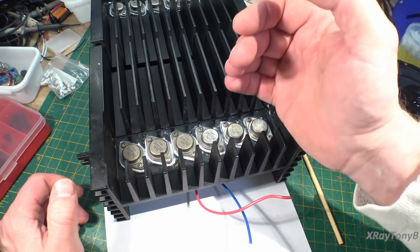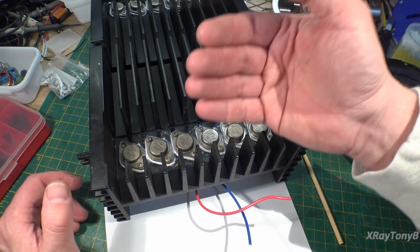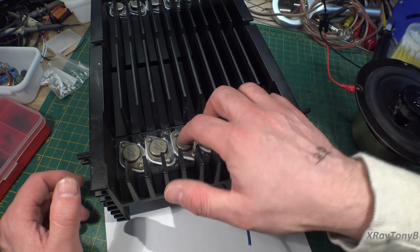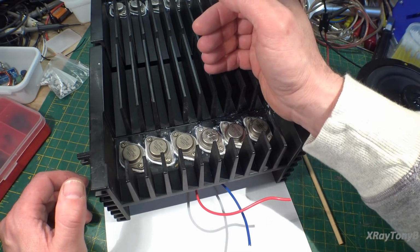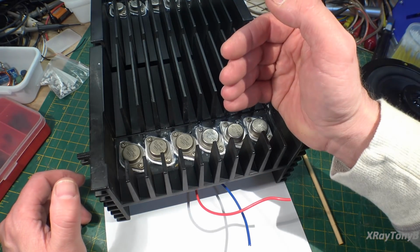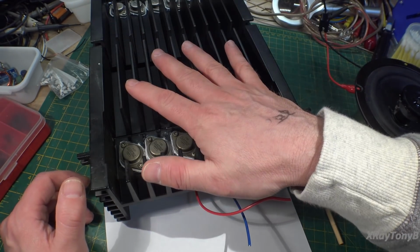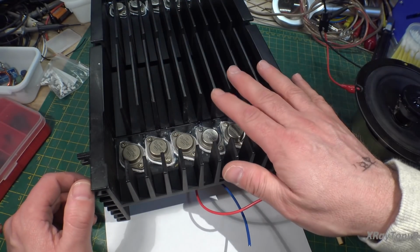Now the other thing that doing this does is it allows the amplifier to be designed to have a lot less negative feedback. So when you look at the amount of negative feedback in this amplifier, it is lower than the amount of negative feedback you would see in a standard design of amplifier. So there again, by not having the proper amount of feedback and not having the proper frequency transistors, this amp actually won't sound very good. So it's an all or nothing thing with this amplifier.